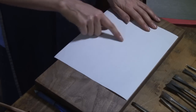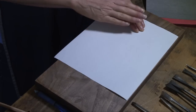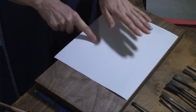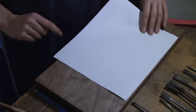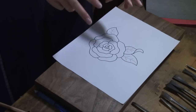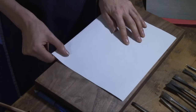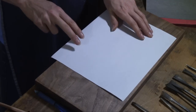What's nice about both the ironing process and the lacquer thinner method is that every single line is transferred. I've even seen where halftones or gray areas also transfer, so you don't have to sit there and draw every little line — it transfers accurately. So if you've got a very detailed design and need it to be really accurate, this is the best method. If you're using the iron, make sure your wood surface is very smooth, because it's basically just going to hit the high spots.